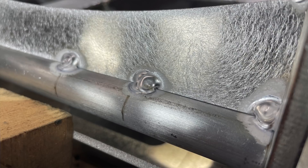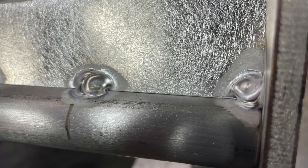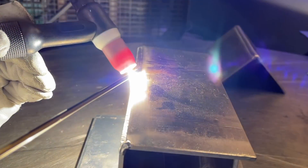Look at this joint here — this is a solid piece of round bar that's been machined down to a specific size, with a piece of three-millimeter plate on top, or one eighth of an inch. So essentially something quite thick with a really thin plate that I have to weld on top of it. I've dropped a couple of tacks onto the joint and done a simple manipulation to see what the puddle is going to do. Obviously, the weld is going to want to go towards the thinner material, so performing a small exercise like this will show me if my torch angle or travel angle is enough to compensate for that variable. Same with joints like this positioned at a 90-degree angle — the tacking exercise serves the purpose of putting the joint together and shows me how my angles are looking when I go to do my actual start.